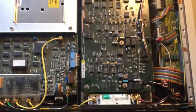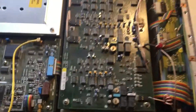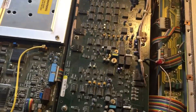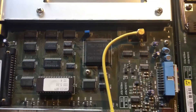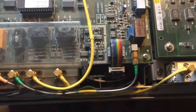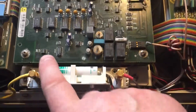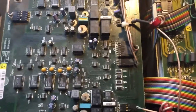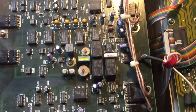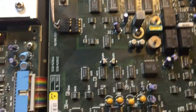I'll give you a quick overview of the top of the board. It's easy enough to access — eight screws and the top lifts off. I've been advised that one of the common faults with these is the electrolytic and SMD caps. There's a battery backup on there too; both surface mount and conventional caps can bulge, swell, or leak, so I'll check all of those.